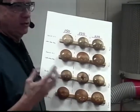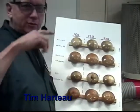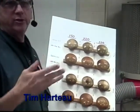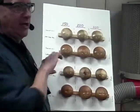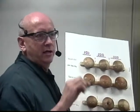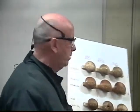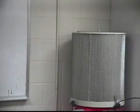It's really simple. When your bowl is on the lathe, you're going to get all of these circular lines from your tool and from your sandpaper if you hold the sandpaper while the bowl turns. In order to get to your finish, it's easier to sand at 90 degrees to those marks and see when they're gone. That's what I'm going to be walking through here in a moment. Basically, you have your bowl, and in fact, I'm going to grab this one. I'll probably use this one right here.